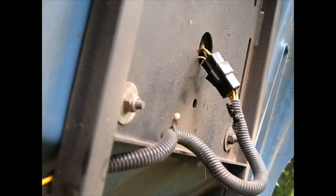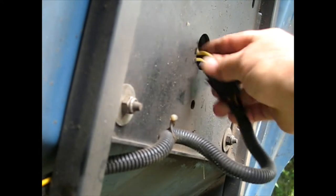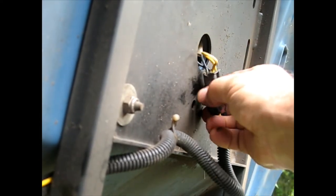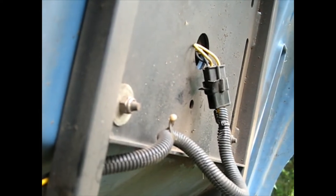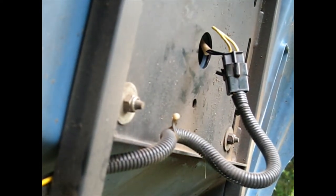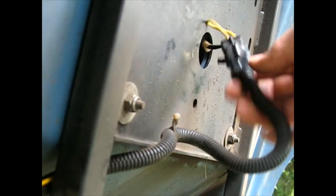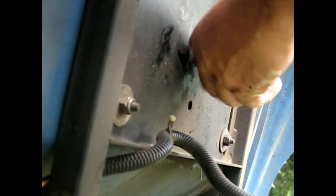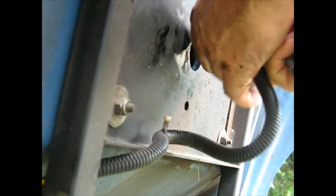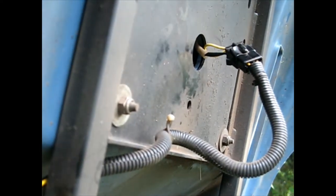It's this one. Okay, that goes up to the seat switch - so possibly we do have to sit on the seat to even try to make this crank, which is going to make things more difficult. The yellow one just goes into the connector, loops and comes right back - it's just making sure it's plugged in. Looks like somebody's been playing and prying with this thing already. So if that's not all the way plugged in we're not going to get continuity through there.